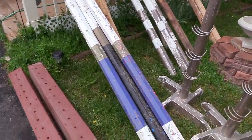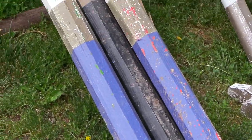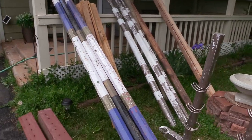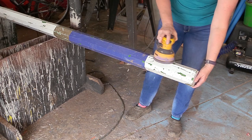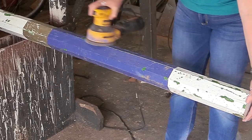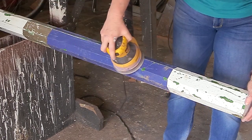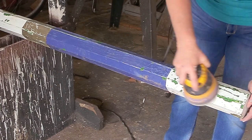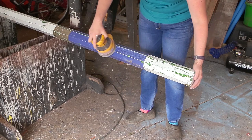Here are some jump rails that I made a while ago that I left outside and the elements got to them. Yep, that's what they look like. So I need to get the rails in shape first before I can actually paint them. The first thing I did was take my handy dandy orbital sander and get most of the rough finish paint off of the rails. This is a really important step — if you're planning on making or repainting your rails, make sure you have a good painting surface.